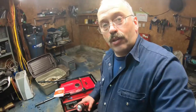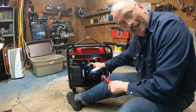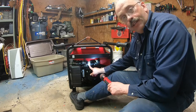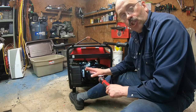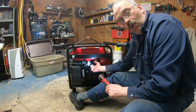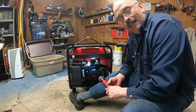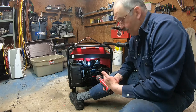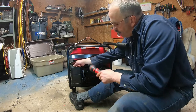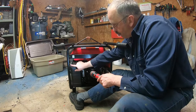Now I'm going to switch the generator, just hold on. All right, so this is the fuel valve, with the fuel bowl here, which catches the sediment. I take so much care of the fuel I'm putting in there. Every year that I remove the bowl, there's nothing. No dust, nothing. That's why it pays to double filter your fuel before you fill it up. Right here there's an indication, that's where you pull. This is the choke for your carburetor.